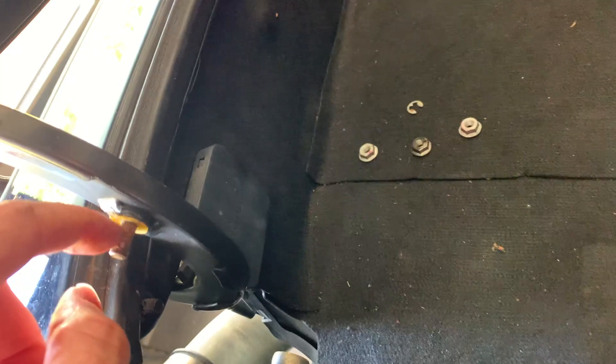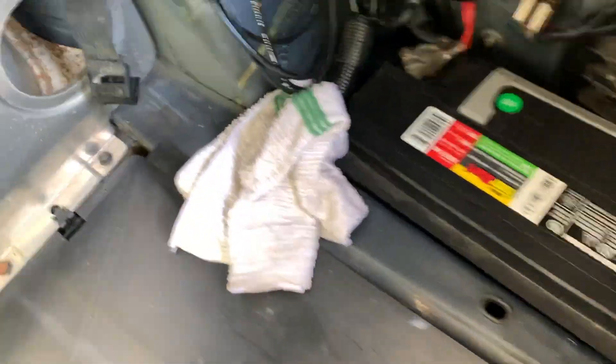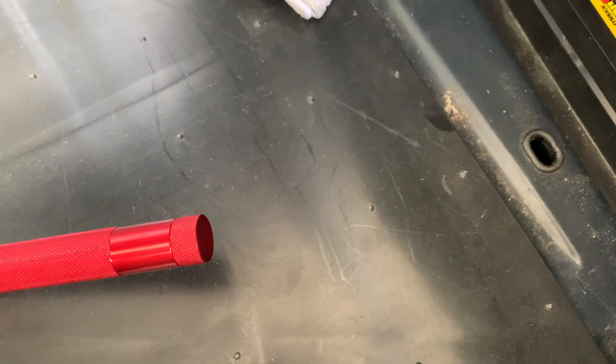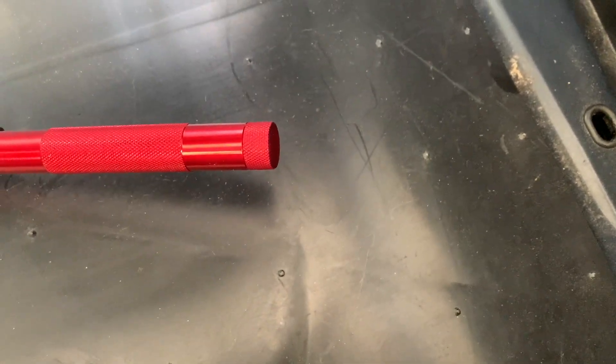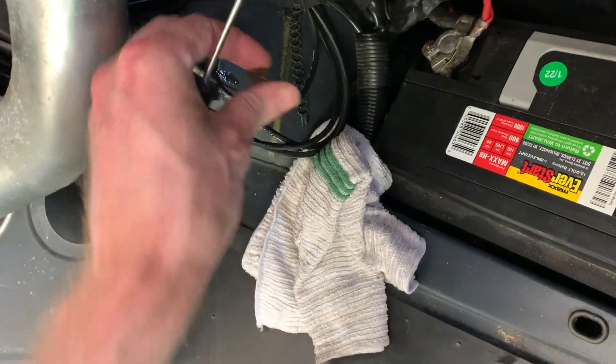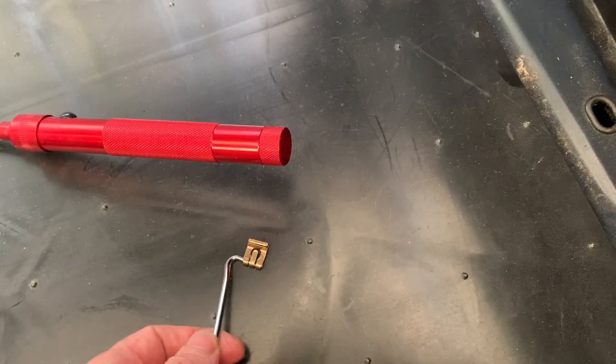Here's the new gasket - the U goes up because it's going up like that as usual. On the other side I didn't put on the bottom base so when I put it back together it didn't sit right - don't forget that goes at the bottom. Easy - gasket goes back in, put it back together, put it back in. On the driver's side they both seem to be straight ones, which is interesting because on the other side one's curved and one's straight.